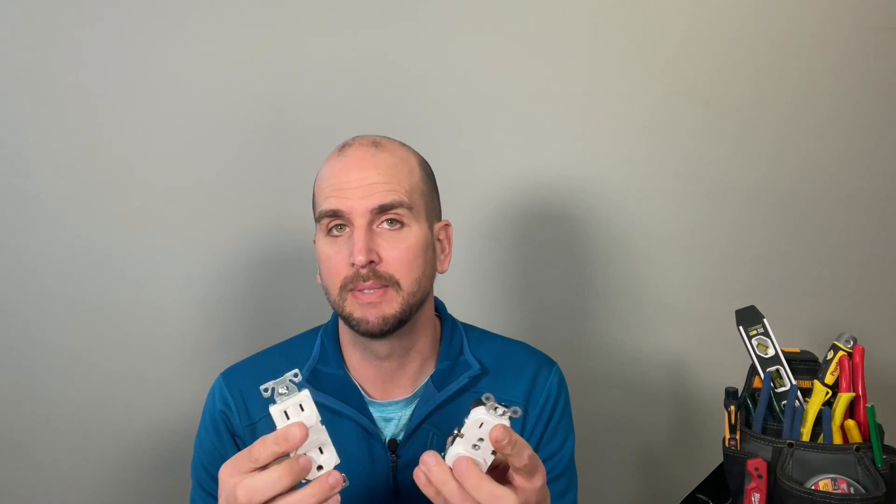So which one would I go with after diving deeper? Despite 68% choosing Leviton and only 9% choosing Eaton, Eaton is my go-to. I may be a little biased — I just installed about 30 of these in another project and they worked great. The two factors that sold me: I like the back wire feature on the Eaton compared to Leviton, and I like how much harder the housing was to break apart — the design seems more robust. I'll keep Leviton as the baseline and compare it against Legrand/Pass and Seymour and then Hubbell in future videos.